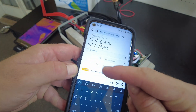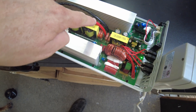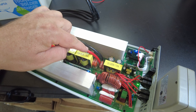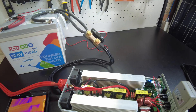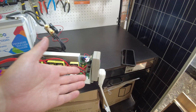55°C would be 131°F, and I can see that the insulation rating on this wire is 105°C. So we haven't exceeded it yet, but we're also only doing a little over 100 amps. I'm going to turn this AC off — that's just driving me crazy.